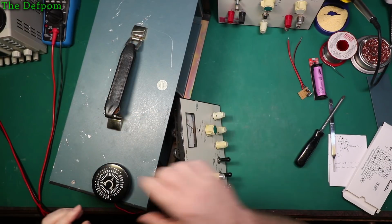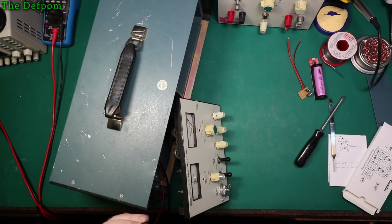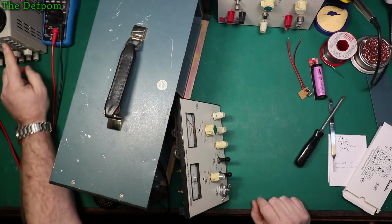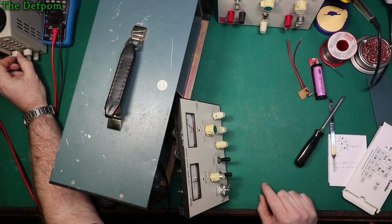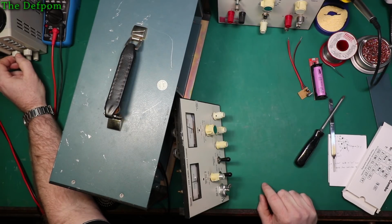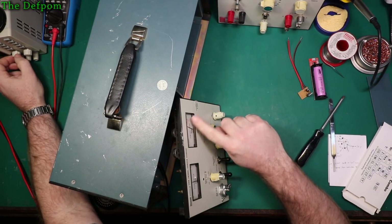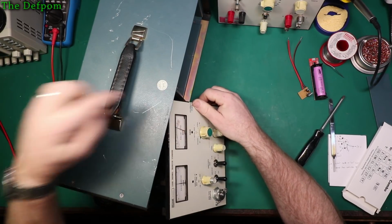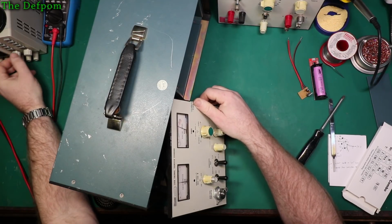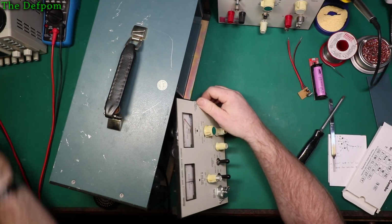That's at 1.5k. Right, if I go to 1k, it's actually close to where I want it. So a 1k is kind of what I want. Okay, but if I change the power supply voltage down by, so if I go down to say 3.7 volts, it's dropped slightly. 3.3, 3.2. I'm not quite sure what lithium cell is going to drop out here. That's 3 volts. So it's still below the marking there for the battery. So the batteries are that first band just there. Alright, it's a very small section at the top there where it says overload as well. In that section is where the battery OK voltage is. So that's at 3 volts there. And that's at the 4.2, which is like the most the battery will be at when it's fully charged.